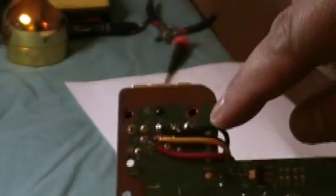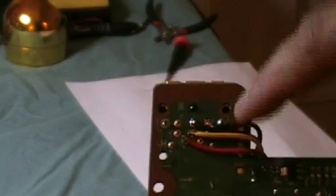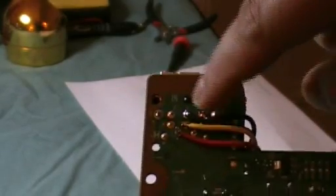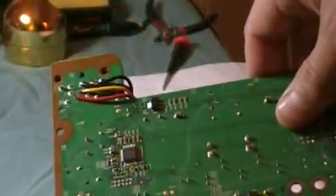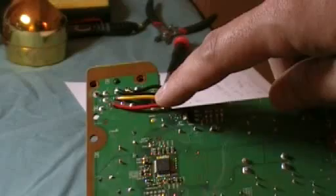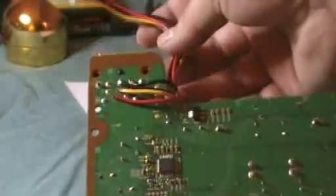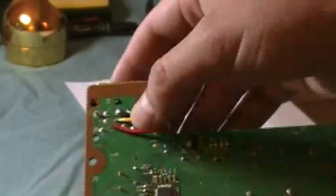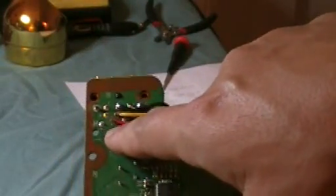You'll see here these pins are numbered. Basically you have ten pins. Pins one, two, and three — where I've got the two black wires wired — those are the ground. Then four, five, and six are your 12 volts. Standard Molex connector: your yellow cable is 12 volts, so I just picked one. And then pin eight is five volts.